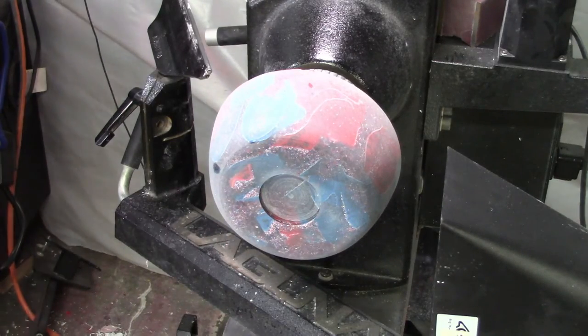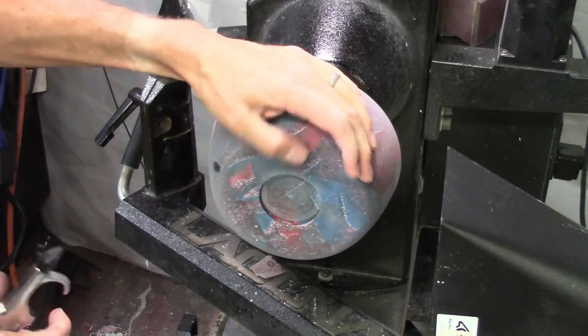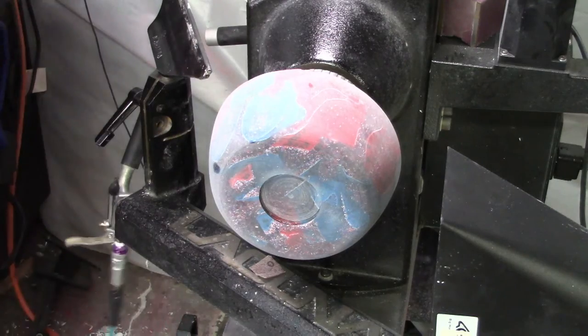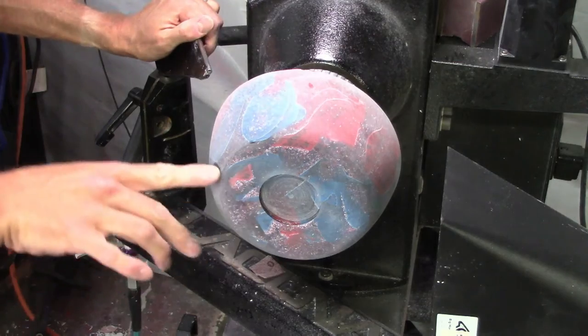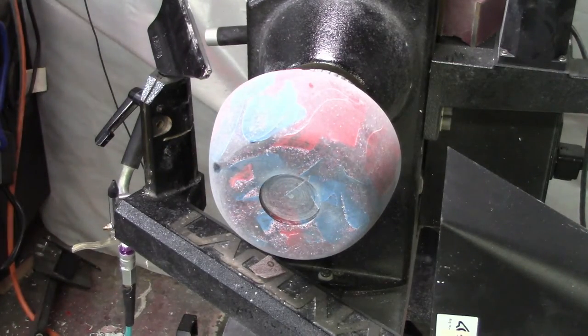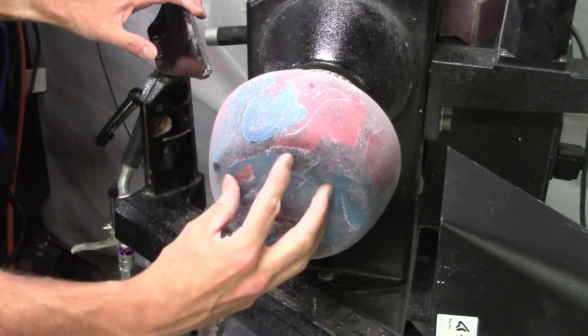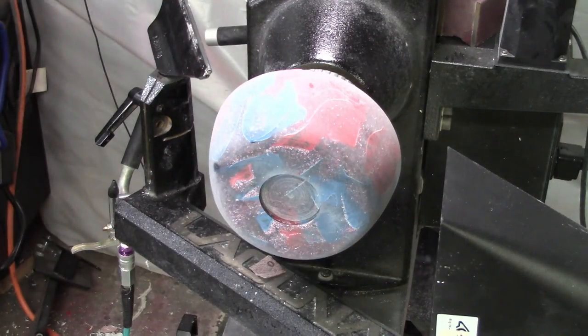The spigots are just kind of hard to, this would be maybe one good reason to go for the tenon, because it's a little bit easier to clean up at the end. But you know, you gotta cut off material and bring it down in and all that kind of stuff. Which way do you go? It's tough. And then the glue block makes things a little bit easier too, because you can use that as the tenon and then just cut it off. So it just depends on which way you want to go. There's lots of different ways to do this.